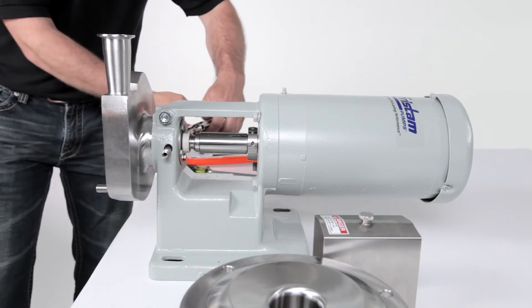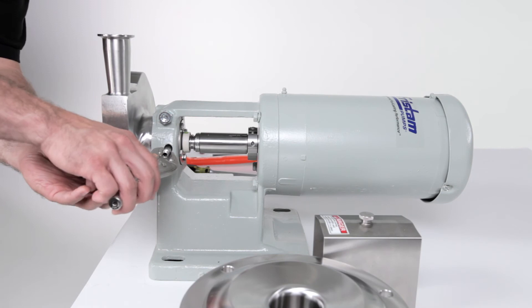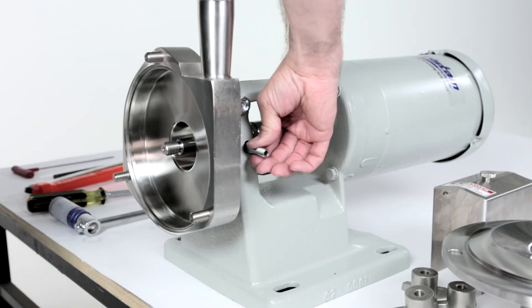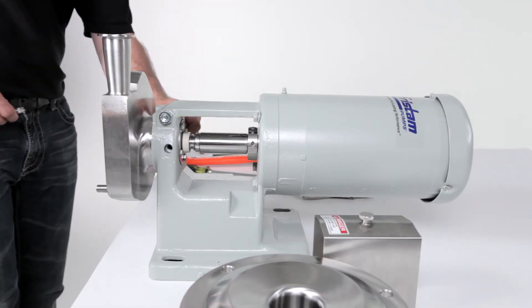Shaft change and gapping. To change the shaft, first remove the pump's cover, impeller, and seals as shown. Remove the seal water pipes on pumps with a double mechanical seal or water cascade option, with the pliers.